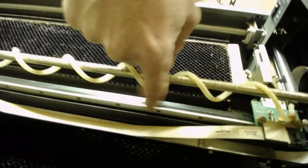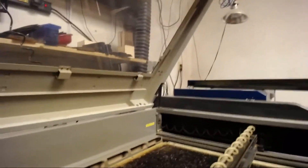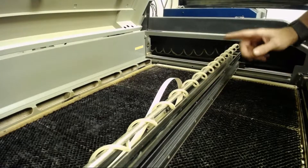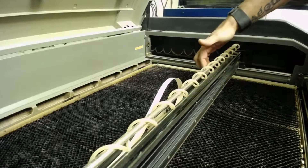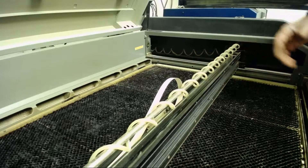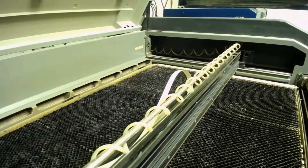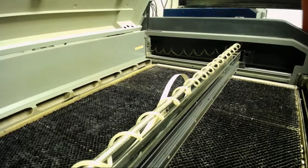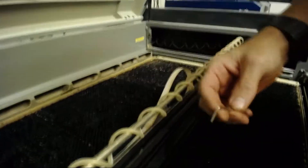So we're going to look at it from the back and you can see there's a ton of little screws — they go all the way across to let this out. There's a whole metal plate and everything. Now you can just clean this real simple with Q-tips and distilled water — just clean the front, clean the back. However, I've been having issues where I'm just slightly tight a few thousandths of an inch, and because of that I'm actually going to take the whole thing off. To take it off properly, we're going to get our hex driver, and we're going to go ahead and take off the reader.